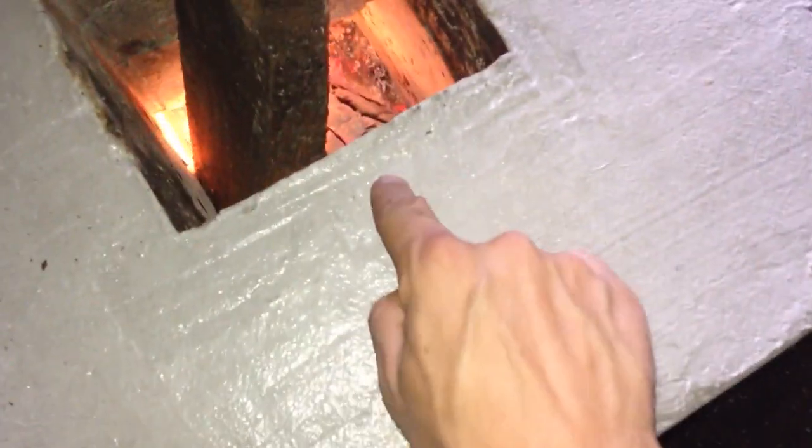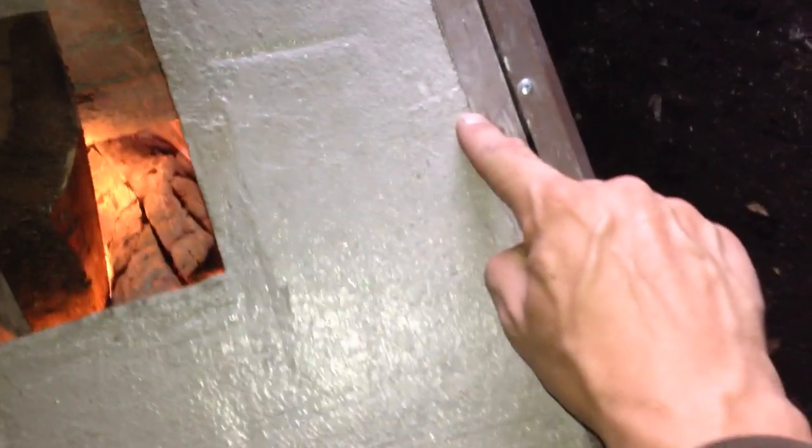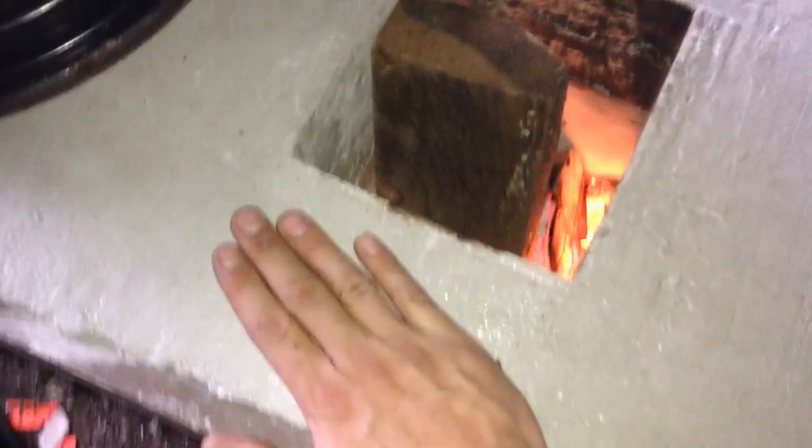It's getting hot closer to the feed — I can hold my hand there just barely. I put my hand on the back side of the stove and no way, it's really hot. I think there's a thinner wall on this side because the stainless steel comes out to the door, so there's probably an extra three quarters of an inch on the other side. If my refractory or casting does crack, I'm guessing it would be right here where cold air comes in from the top and front meets the heat. I haven't got any cracks yet.